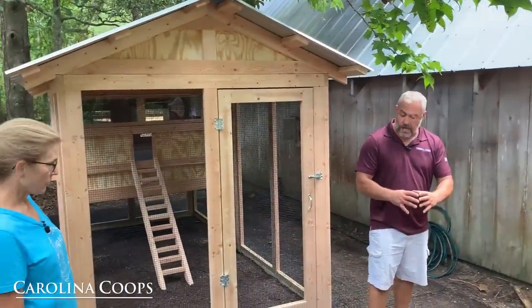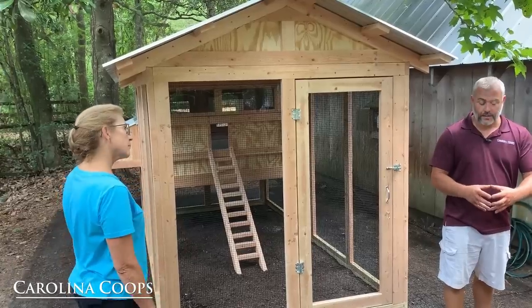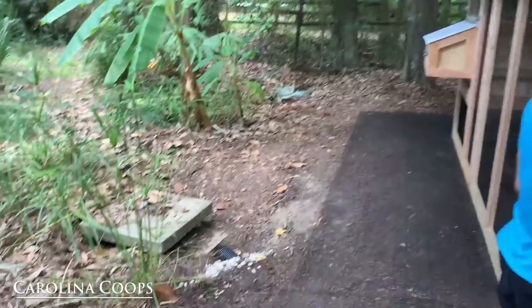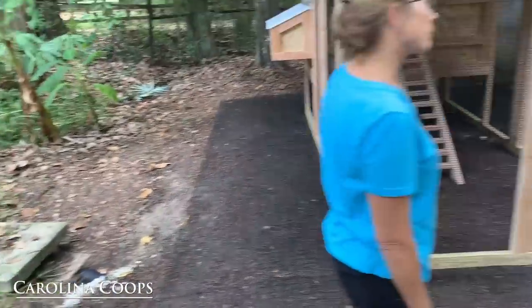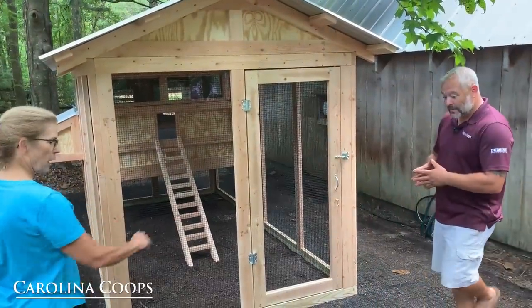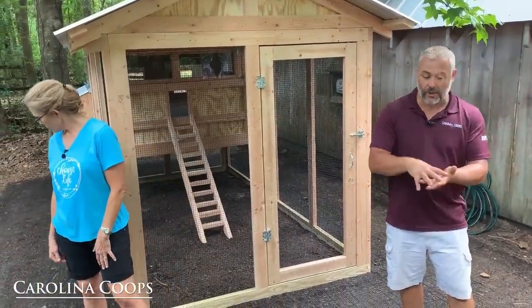And we can get a shot of it over there. We call it tiling, but basically it's a corrugated pipe that's about 4 inches. When the water goes through the soil, it's going to hit the inside of that pipe, path of least resistance, and run right to the lowest point. So I love what you guys have done. Absolutely perfect. I have the Bahama rock on top too. Oh, right. Yep. Keeping it so that the water can go right through it.